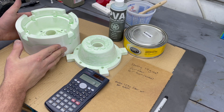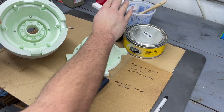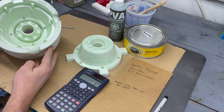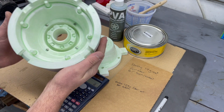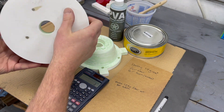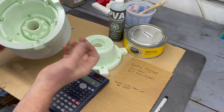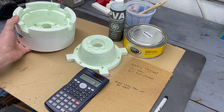We've got the second mold all prepped up. We've got it hit with wax and then some PVA for a mold release. This one we have these nails acting as ejector pins, filled in full through the back with non-hardening clay. Hopefully, that will make it a bit easier to pop the part out of this side.